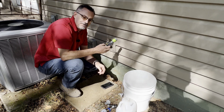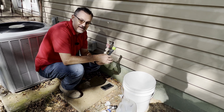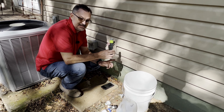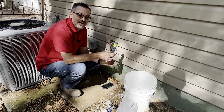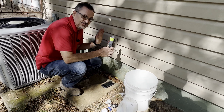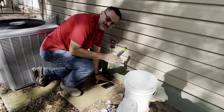If you're wanting to determine how much water your well can put out — I'm on a rural location with a water well — you want to pick a spigot that's as close to your well as possible, ideally one actually at your well. You're also going to want to make sure you're draining at least two water sources at the same time and measuring both, because your well should keep up with one spigot but might not keep up with two. So you would do this at two locations at the exact same time — put the meter on one, and use the bucket method at the other.